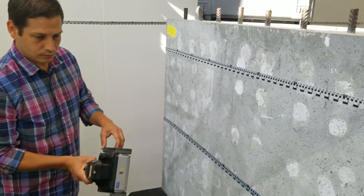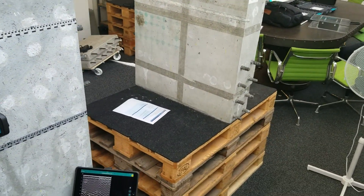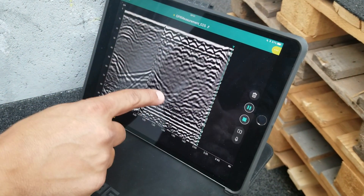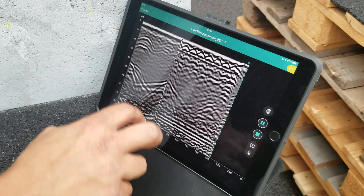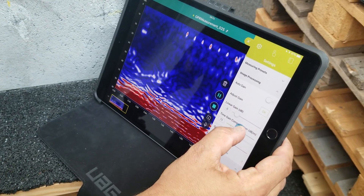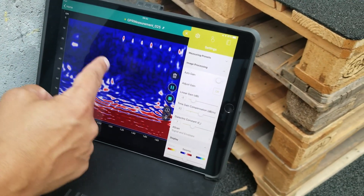Alternatively, when I go to the top over here and we start hitting rebar, you can see that the amplitudes of the response off the back wall, when trying to go through rebar, are significantly lower compared to the bottom of the slab where there was no rebar. It's even more apparent in the migrated view. Here, this is the bottom of the slab — clear back wall, no signal impediment from the rebar — where on this side, you can hardly see it. You can kind of see the V-shape a little bit, but it's not nearly as crisp and clear as where there is no rebar.